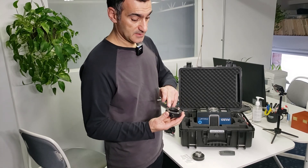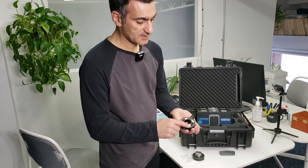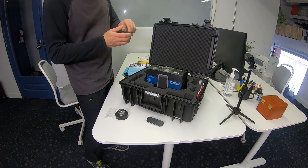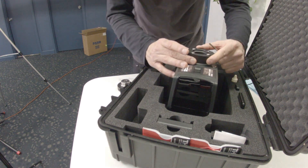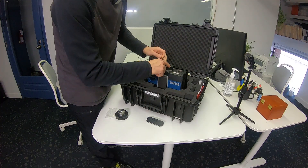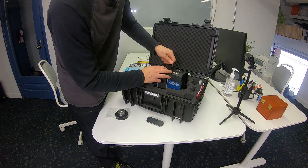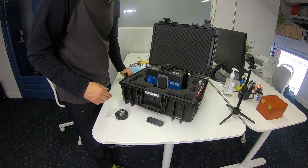The way this works: I loosen the bolts up here with the Allen key or hex wrench that was supplied. That loosens this part, and I screw it in so this piece squeezes onto the little bracket. When tightening, I tighten from opposite sides little by little — I don't want to over-tighten, just make sure they're snug. That's feeling pretty good — it's definitely holding now.